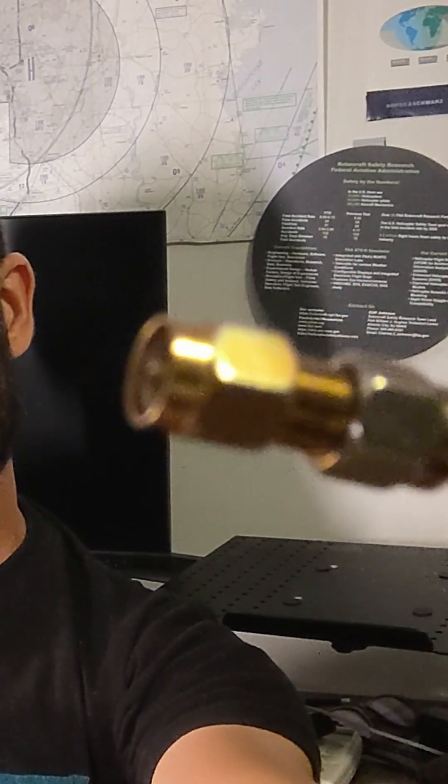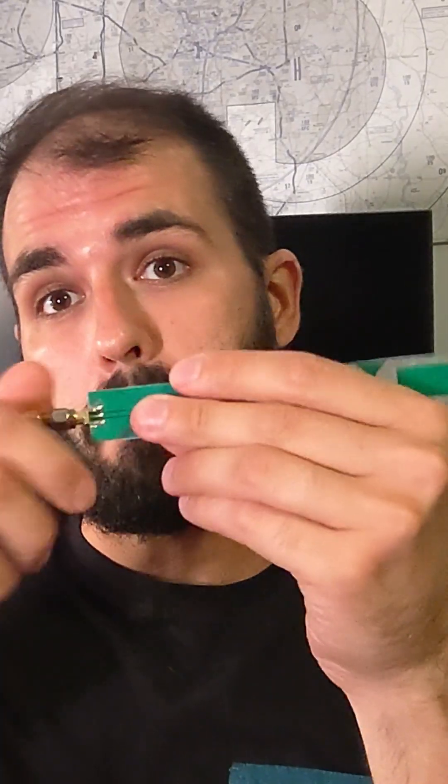What you're going to need is a Raspberry Pi — here's a 3B or 3A, I like the threes. A micro SD card. An RTL SDR, this is a $30 dongle. I would recommend an ADS-B specific antenna, these are about $10. And you might need this little adapter on the end — this is an SMA male to male.